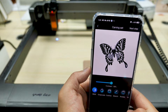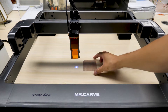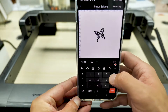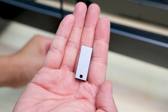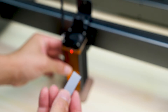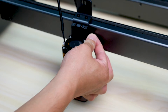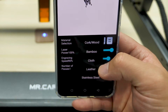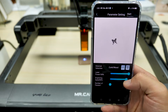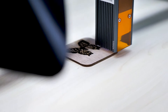I choose black and white mode since this is a simple line picture. Go to the next step, fill in the size, and press smart positioning. The M3 will start previewing the image — move the object under the laser engraver to make sure it's in the right place, and adjust the size in the app if needed. After that, adjust the focal distance using a small cuboid called the fixed focus column. The height is 5mm, which is the exact focal distance of the blue laser head. Place it on the surface of the object and loosely screw the laser head so it just touches the column, then tighten it and remove the column. Go to the next step, choose the material from a wide range of options, and you'll see the engraving parameters — normally you don't have to adjust any of that. Finally, press Start Carving. The app uploads the image and the M3 starts engraving.